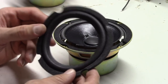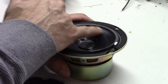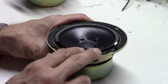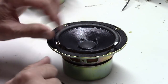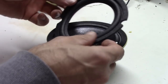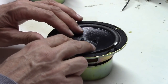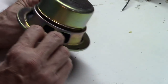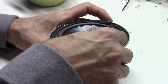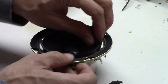When you go to put the replacement in place, you'll need to glue it all the way around and also to the edge of the cone, so the surface has to be cleaned off really well. On a lot of these the surround is glued to the back; most replacements you glue to the front — it doesn't really make any difference. The idea is it keeps the cone from shifting side to side so its travel is straight back and forth. If the old surround is still relatively intact, use a razor blade to go around it and start peeling off the old surround material.